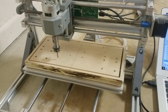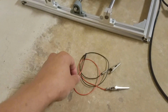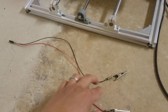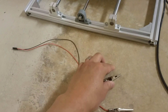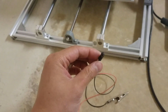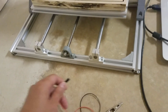So I followed the guide and here's what I made for the tool probe. You only need two wires connected to alligator clips on one end, and on the other side a 2.54mm connector so you can plug it directly to the back of the control board. Let me just show you where to plug it in.